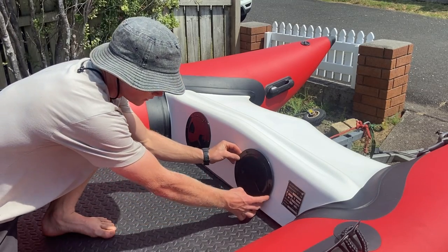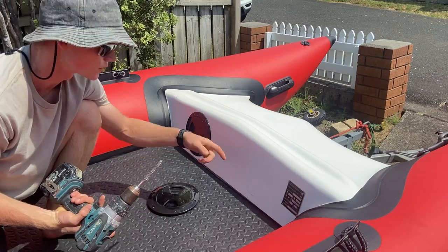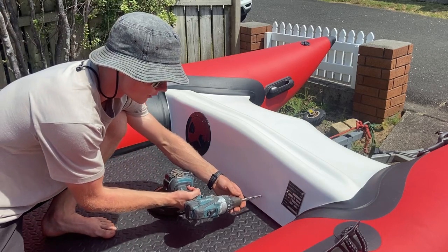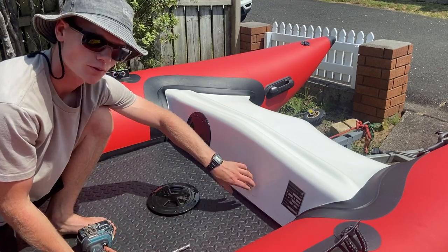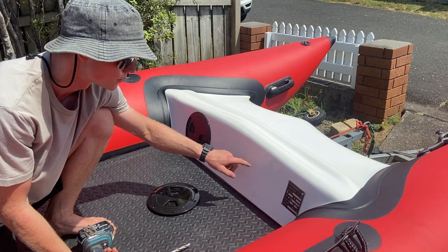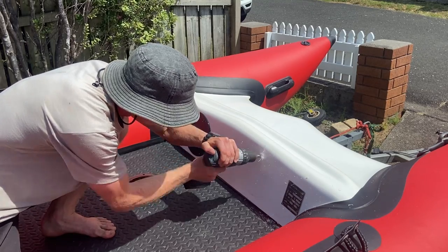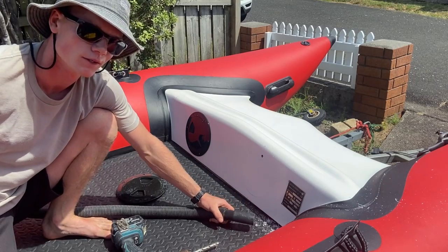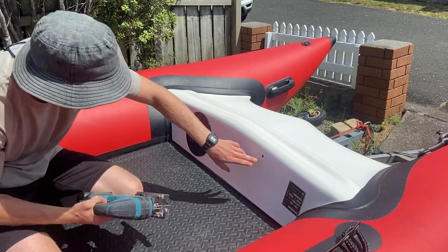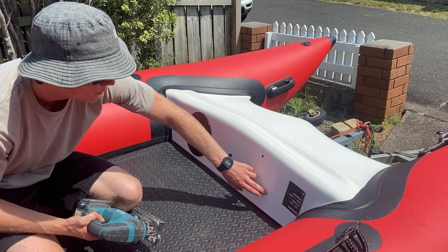Now that you're sure your marking is correct and you're happy with where it's going to go, you want to drill a hole and then use a jigsaw to cut it around. Alternatively you could drill holes right the way around, press it through and sand it back, but I'm going to use a jigsaw to cut a nice hole. Start by drilling your hole — it helps to have a vacuum to get rid of all the material as you go. Then grab the jigsaw and follow on the inside of the line, not the outside, to give you your rough cut circle.